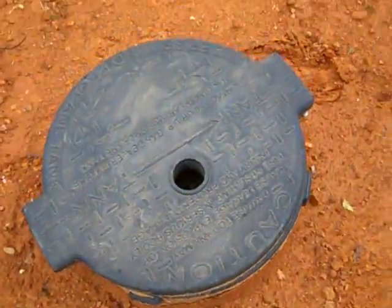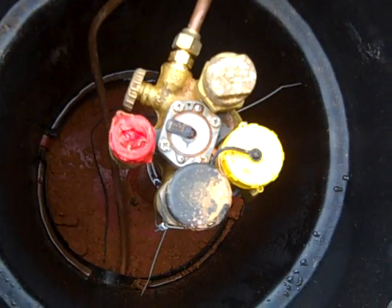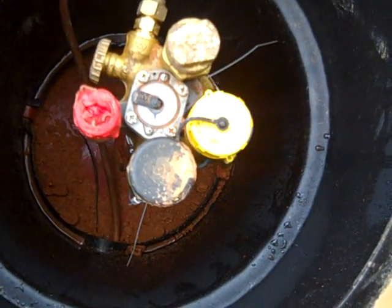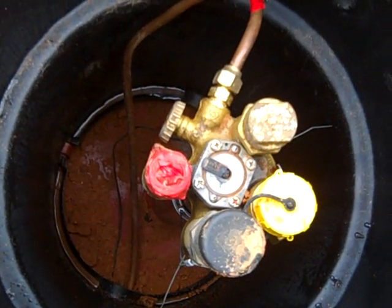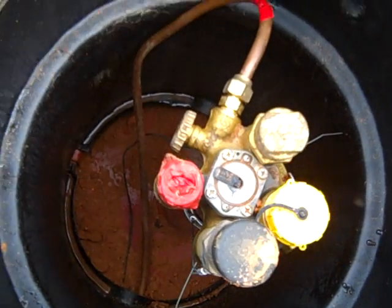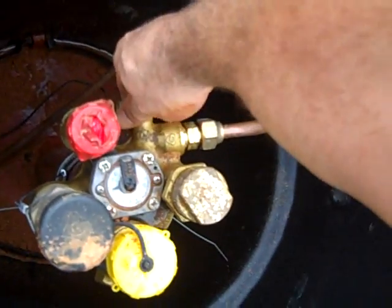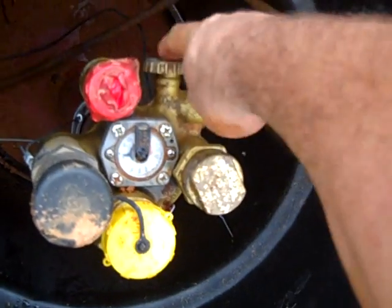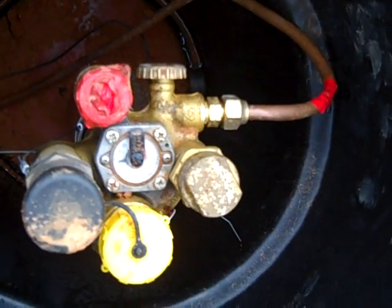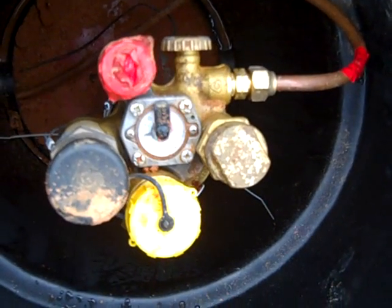The second tank is sitting at 82% as well with no regulator on it — it's shut off right now. If you need to turn it on you just turn it on. I wanted that level of control, and it's done through the T-block and the other five-way valve. The reason is human nature — people forget and let tanks run down low, so I want to guarantee a backup.